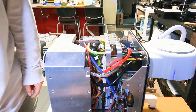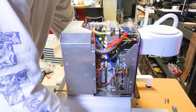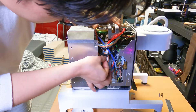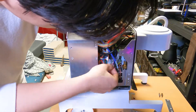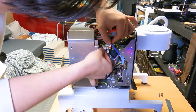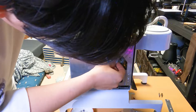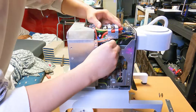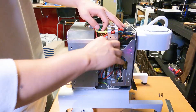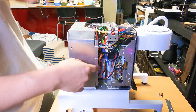Now you need to put the red-carrot colored tube in — click it in. Now reconnect the sensors back: the seven-pin cable goes in here, dark blue goes in here, orange cable goes there, gray cable goes here, sky blue goes there, and brown goes on the top. Done.